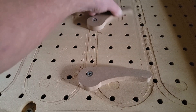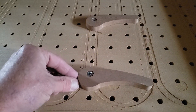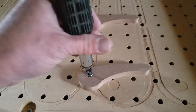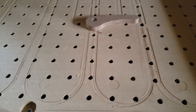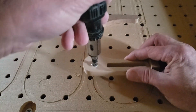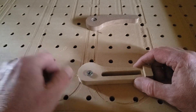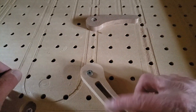So let's see what we can do to make use of the handle. Here we are with the cam clamp — this is what we started with, and as we discussed, this is the only part that offers any clamping at all; this is just the handle. Instead of making it ergonomic or putting a dragon's head on the end just because you can, I want to make them more usable for other things. That's where we have this modification. I didn't do a pocket in these, but this will still suit my purposes — still got the cam action.